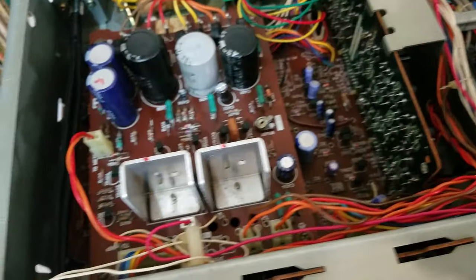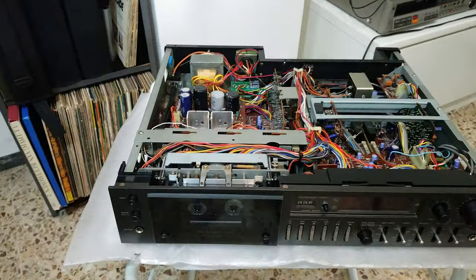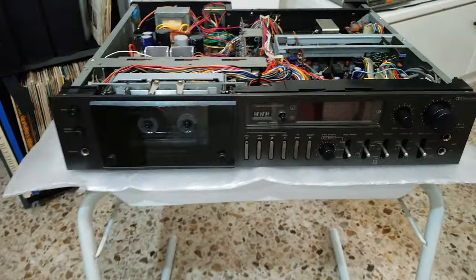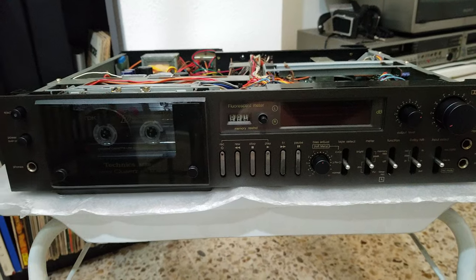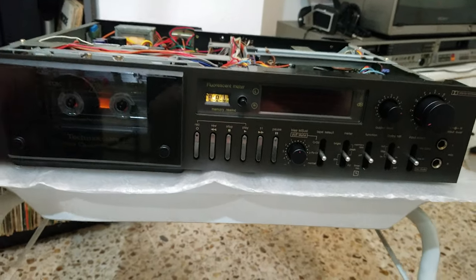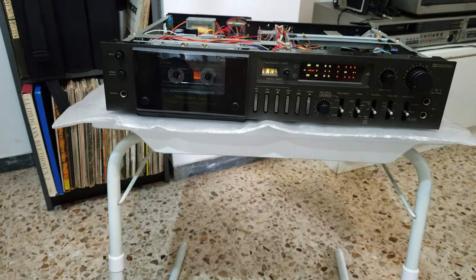This red wire is connected to the power supply point which is plus 5 volts. The most difficult part was finding a place for the infrared phototransistor — this is a very packed front panel. There is a small hole more or less over here, and it is enough for the phototransistor receiver.